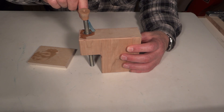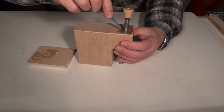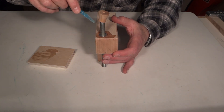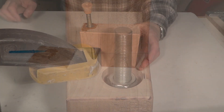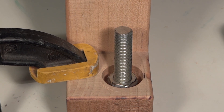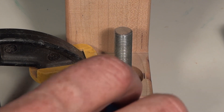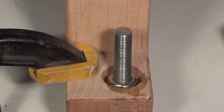I've put epoxy in between the side of the nut and the wall of the recess, trying hard not to get it on the threads of the rod or that of the nut. Now I have to let it sit for 16 hours according to the instructions. I confess, I did not wait for 16 hours — in fact I waited for about 2 hours — but I think it's set up enough that I can at least work on this side a little bit now, try to get some epoxy down in here, and then I will wait 16 hours before I mess with it anymore. At the moment, the two nuts are spaced well enough that it does swivel without being too tight.